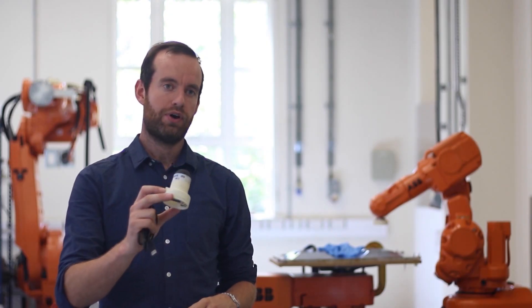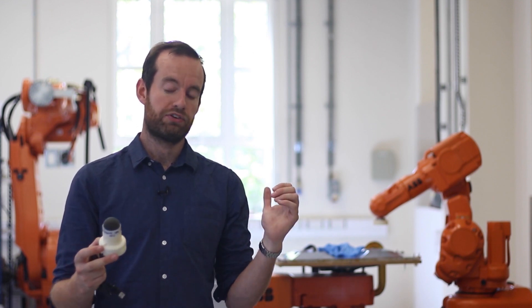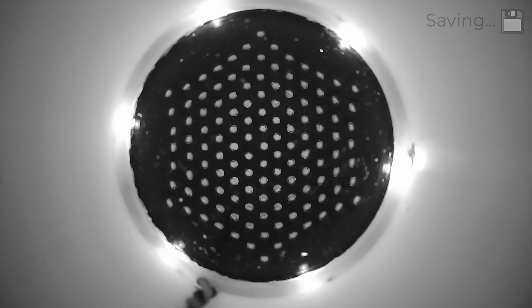The way the TacTip works is not by exactly calculating the shape underneath the surface, but actually by comparing two sets of images to work out if there's a difference, much like you've just seen. If you want to use it as a sensor during layout, you first need to teach it what it should be seeing. To do this we do a training run, where the TacTip is pushed down onto the surface, compacting the prepreg. At the lowest point of every tap, a screenshot is taken of where the pins are and recorded as a record of what shape it should be seeing.